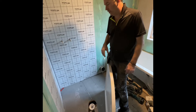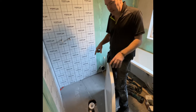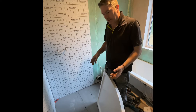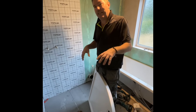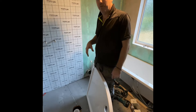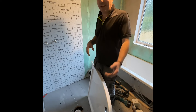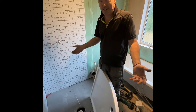Up here, what you need to be doing is if you're not putting a board down, you need to prime it with a sealant and then use rapid set, because rapid set will be dry in three hours. If you use sand and cement, the moisture can't get out and it can only go down. He came into Travis and said his shower tray had fallen through the floor on Christmas Day — a couple of months on, Christmas Day.